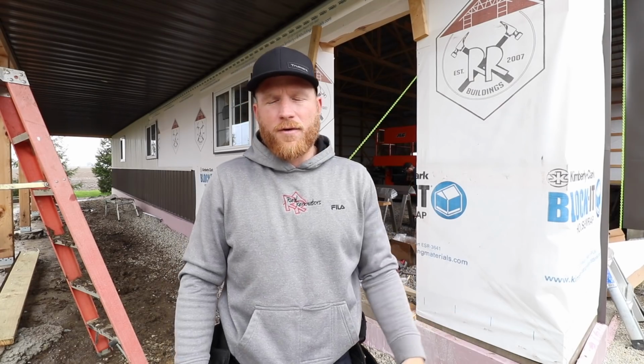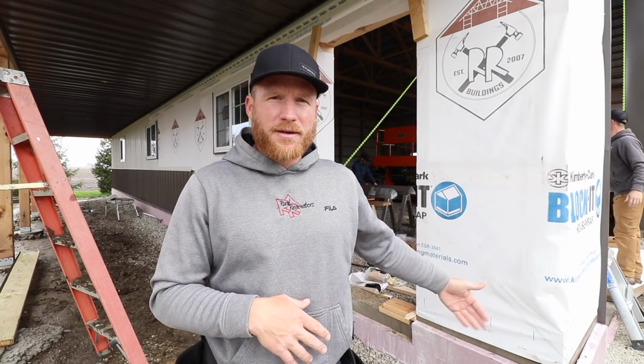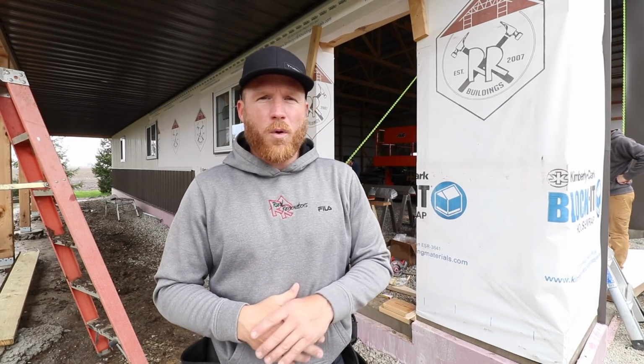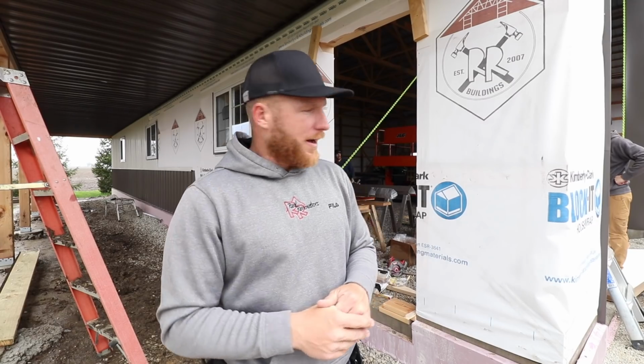So now with these walk doors, when we've got a foundation wall, what we try to do is put this knockout here. Now, the knockout was not done when the wall was actually poured, so what we had to do was cut it out. You guys maybe remember that in a previous video. So what we do now is we put some blocking in there, and that's just temporary so we can set the door in there, get it all plumb, get it level, get it exactly where we want it. And when the concrete gets poured for the floor, they'll actually take those blocks out. We just got some shims in there, and then they'll pour that finished floor right through. That'll lock in the sill of the door. And then it'll also give it a nice clean pour through the threshold, which would not have been there had we just left the wall flat through. You would have seen the top of that wall when you got into the door jamb. So it's a little bit extra work, but when we have a wall, this is kind of how we have to do it.